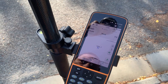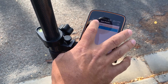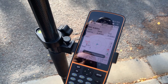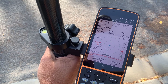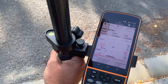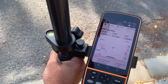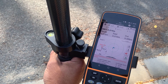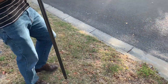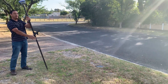Now I'll go to 'Points Stake Out' and call up that point. That just shows us that we are on the point, and every beep you hear is the program telling us we're within five centimeters — actually three centimeters — that's the actual calibration setting. The accuracy is pretty good. So let me just walk off a little bit, and now I'm going to go into a tilt scenario.